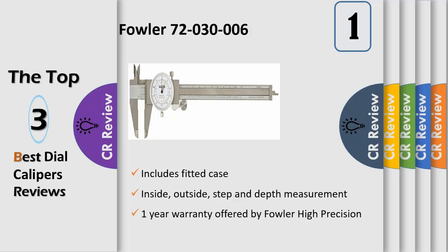The gauge has constant spring pressure for repeatability and Bowers fast-fit measuring heads for rapid measurement. It uses a 3-point contact system for the detection of lobing or triangular form error, and ceramic contact points provide durability and stability with regard to thermal expansion.